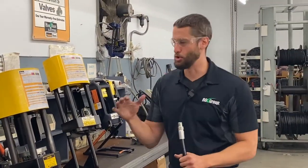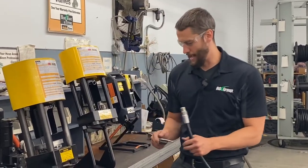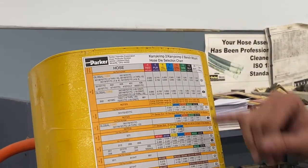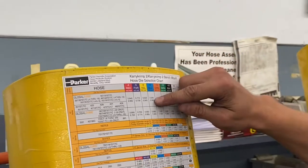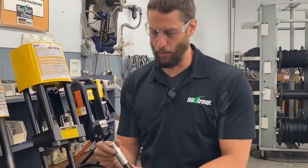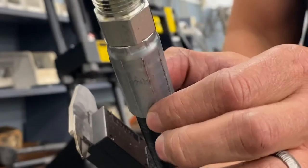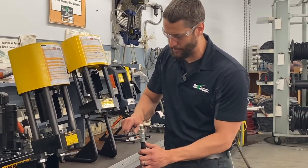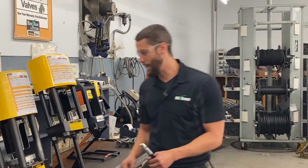It's that quick and easy to use a Parker crimper. One thing we always recommend is to routinely check your crimp spec. All you need is digital calipers. Come back to the chart — we know we're using 43 series fitting, 471 hose, dash 8 size — and it gives you two numbers representing two different crimp diameters. You want to take two measurements of the flats of the crimp to make sure you're within range. We measured 0.956 and 0.954 — we're perfect where we need to be.